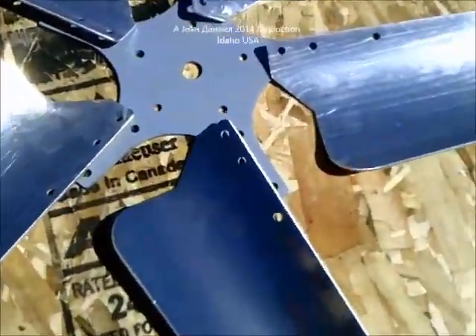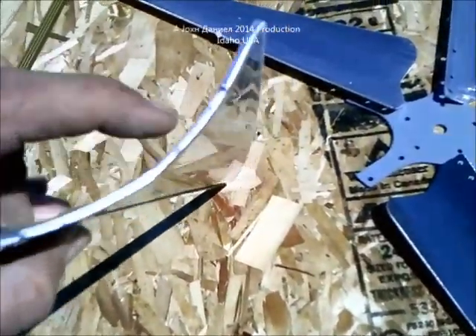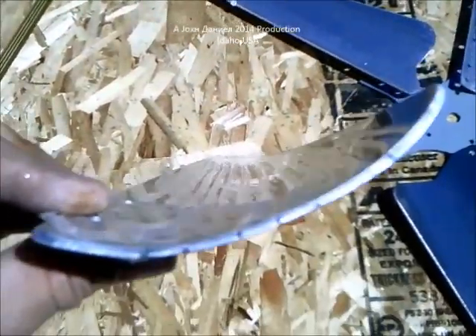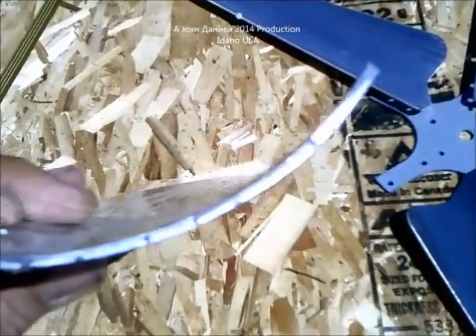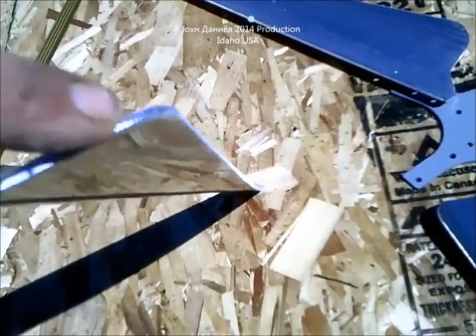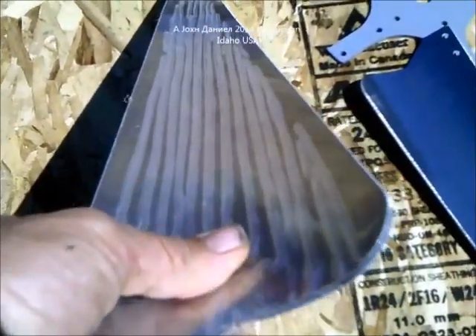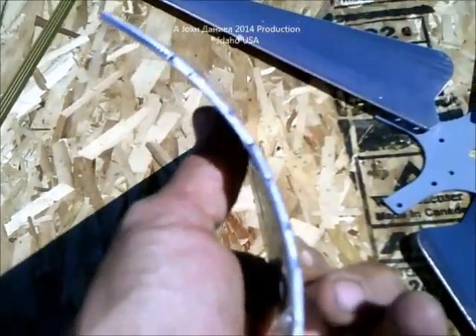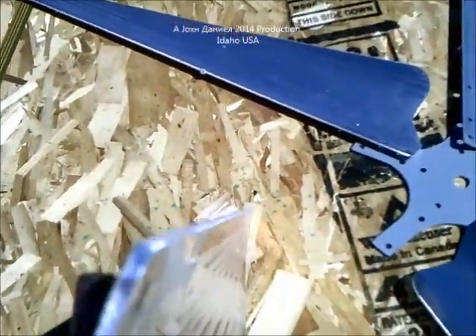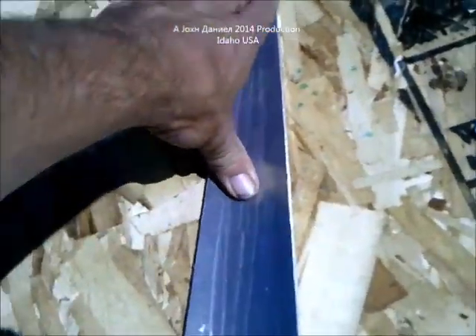This is the Windy Nation setup, and we'll get them all bolted. It looks a little strange in the ad - it looks like it's got a little raise, but that's just the way these are cut in. However, the blade is very well stamped, and you can tell that it's done right because you see those little notches right there? That tells you that it is a massive pressure stamp, so that would get the aluminum fairly hot in the process, which would mean it's not gonna lose its shape. That's an impressive start. The blade also has a natural cutback stiffener in it - just a slight cutback in this area to get to that flat point that's your high-speed area.